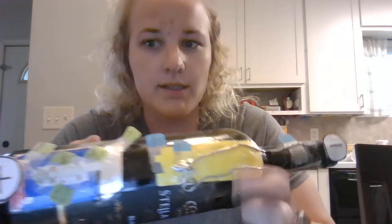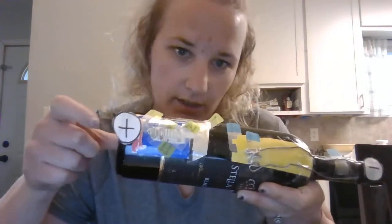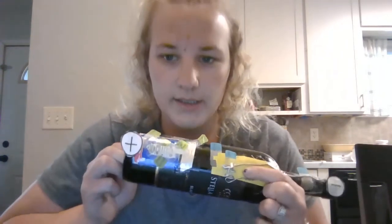Once that happens, the electrons are released at a high voltage and are pushed to the anode, which is over here, target to produce photons. And as I briefly mentioned, this yellow part is the focusing cup, which holds the filament. This is made out of nickel, and its job is to narrow the thermionic cloud as it is driven towards the anode. Since the filament shoots out electrons which have a negative charge, it just helps them stay together.